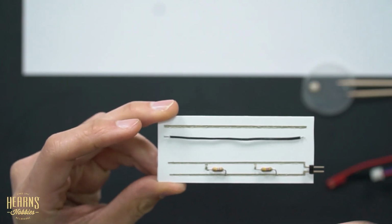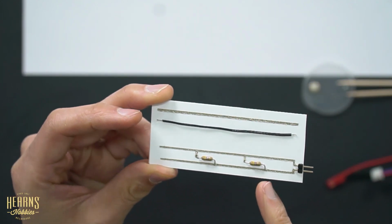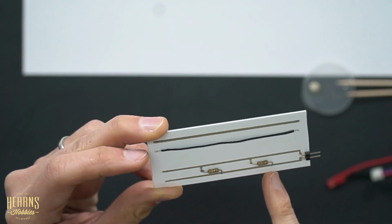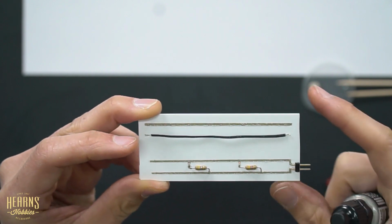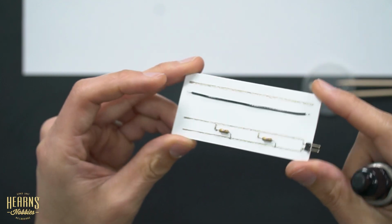And then where it gets really complicated, say you're doing headlights for a car and it has two headlights, you can actually just glue the LED onto a backing plate like this, use conductive paint for making the circuit, and you just freehand it on. It doesn't really need to be pretty, or if you want it really straight and neat looking, you can always do this. You can mask it up and you'll be able to see all the lines there. And then the components, you just need to glue them on to the surface, because the paint itself is not going to hold together like solder will. But unlike solder, this is not going to burn you. You don't have to worry about any of the fumes or any lead. And in no time at all, you can make circuits work and it'll be permanent.